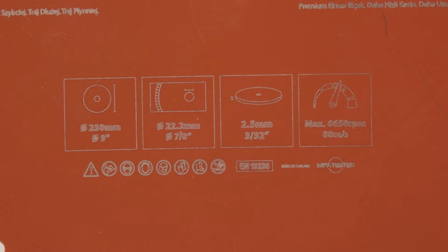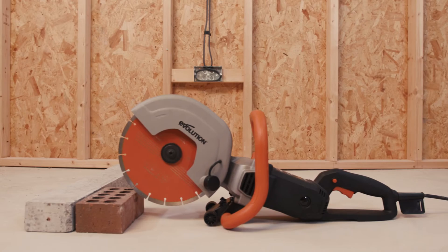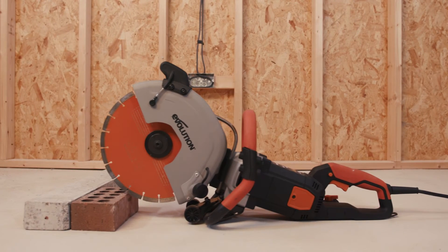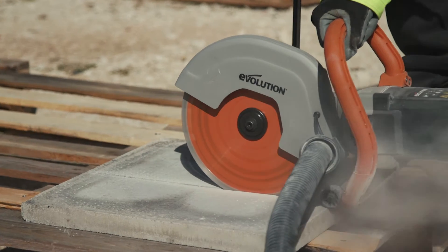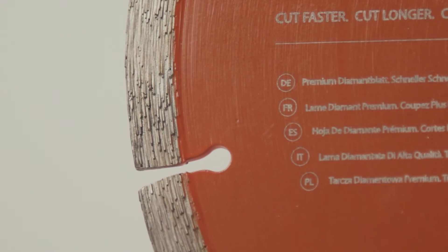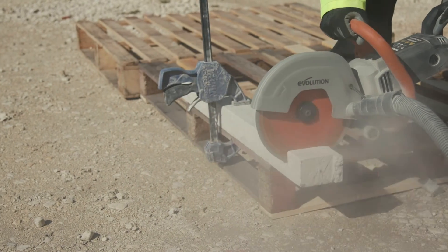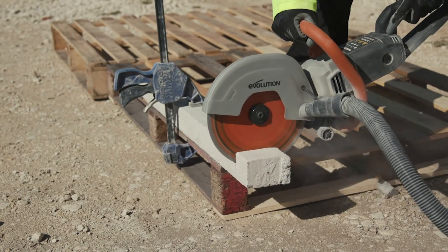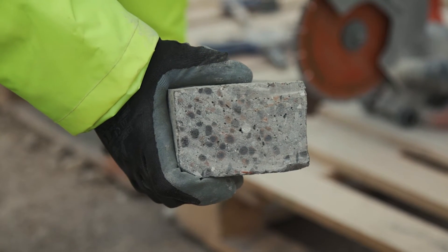There's also a premium quality diamond blade available. This blade is included with the R255 DCT and the R300 DCT Plus. It cuts both quicker and lasts longer than the general diamond blade due to its higher diamond concentration and deeper diamond edge. It's ideal for cutting rebar reinforced concrete lintels at least 10% quicker than the general blade and leaves a quality clean finish.